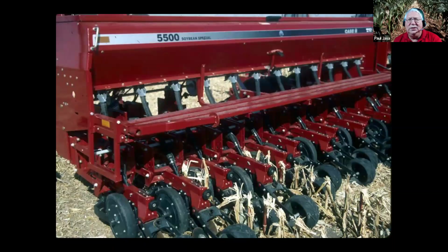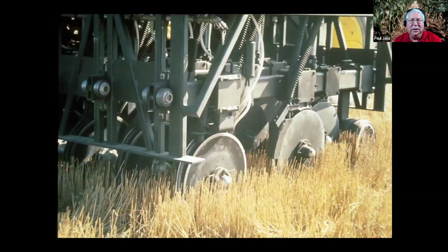And it comes down to it, these 15-inch planters, I love what I call even row planters. With even row planters, you're going to have 2 rows between each of the standing rows of residue. You're going to leave a lot more residue standing. What I hate is the odd row planters because now I've got my front set of rows running down my old corn stalks. The rear set of rows is running either in a soft row or a wheel track row. And so I tend toward the even row planters.